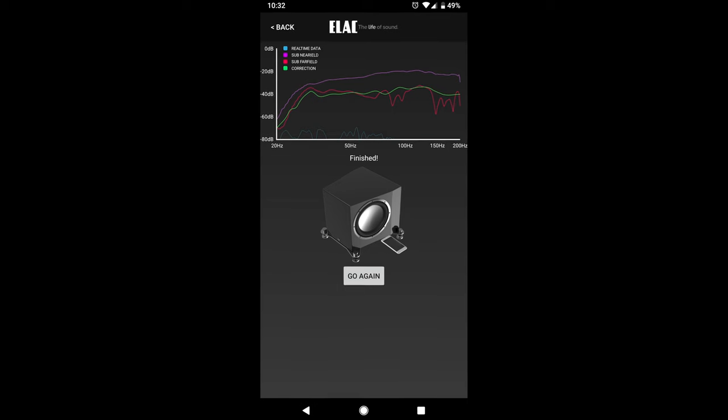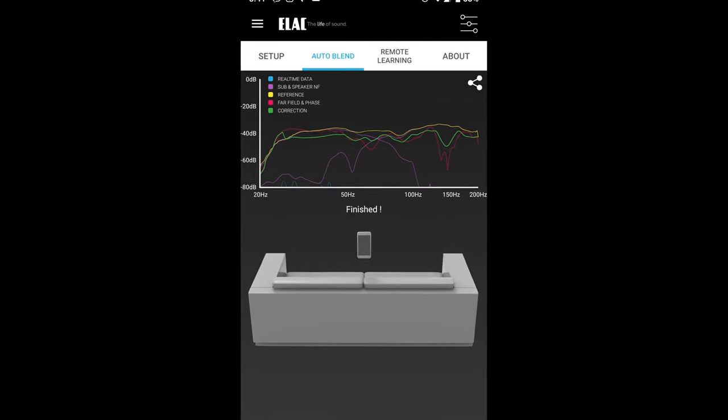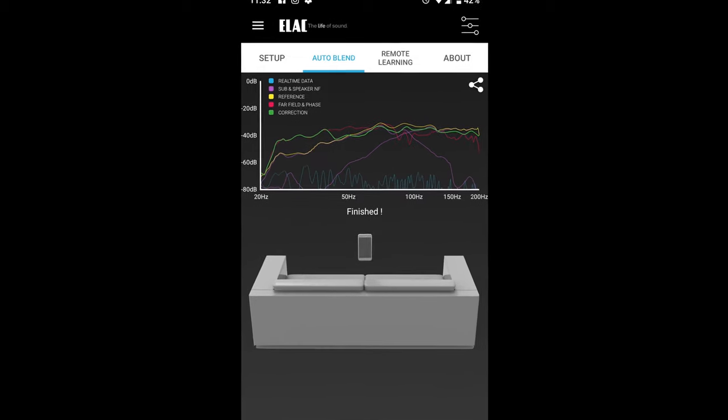But it's more than just a simple two-channel amplifier. We put in a DAC, we put in DSP, and with that we put in the room correction algorithms that we've had available in our subwoofers. So now on a two-channel system, your main speakers can also be equalized for the room. We use quite a novel way of doing this — we use the microphone embedded in your phone or tablet. Although it's not calibrated, we can get around that by first making a measurement close to the speaker, which becomes our reference point. Then we make a further measurement at the listening location, and by simply EQing the listening location response to match the response measured in the near field of the speaker, we take the characteristics of the microphone out of the equation. So it becomes a very simple way of EQing a system into the room.